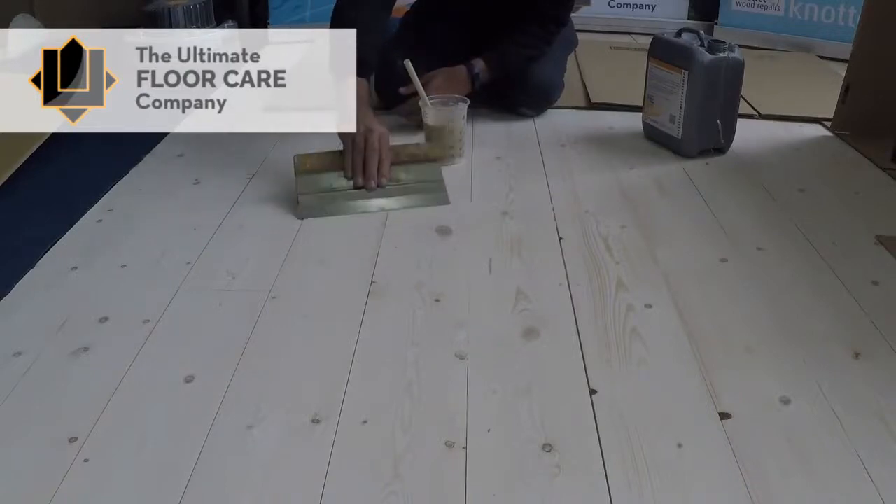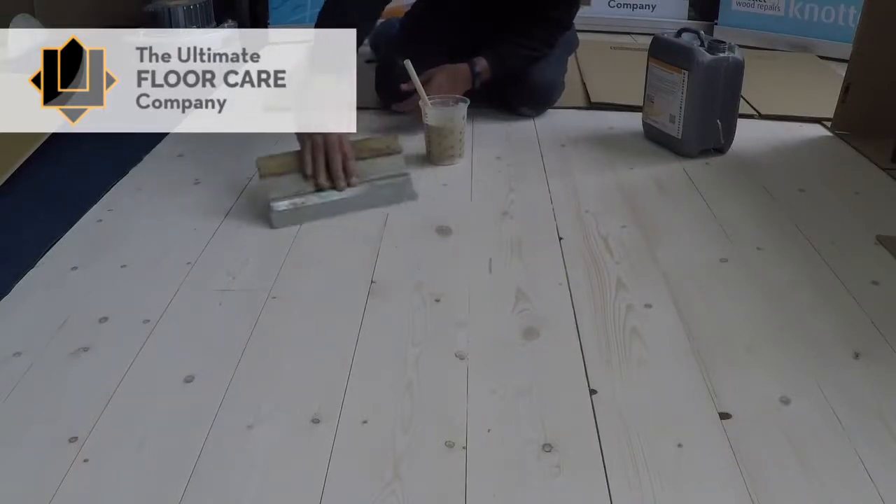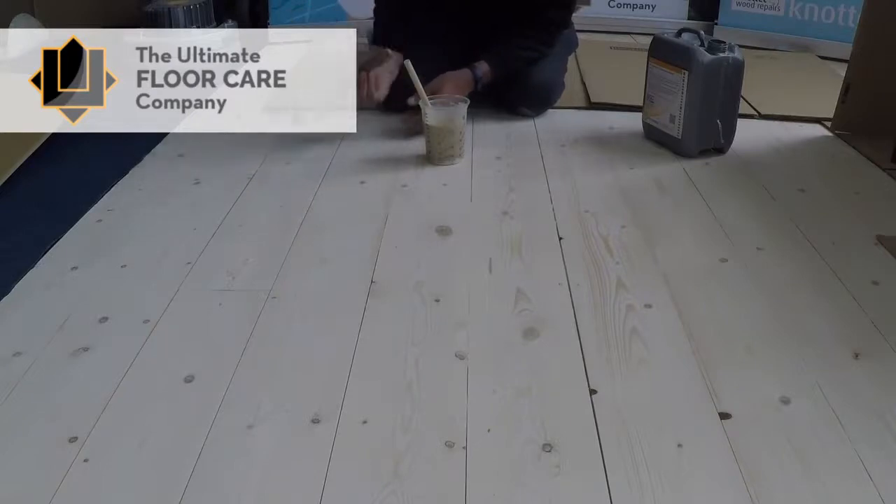Use it with your fingers just touching the bracing bar — that will give you the right tension. You're going to be doing it at roughly this kind of angle across the floor. Try not to pick the trowel up too often, because the more often you pick it up and put it down again, the more likely you are to get grit and scratches across your floor.